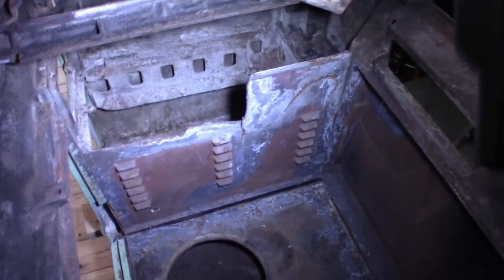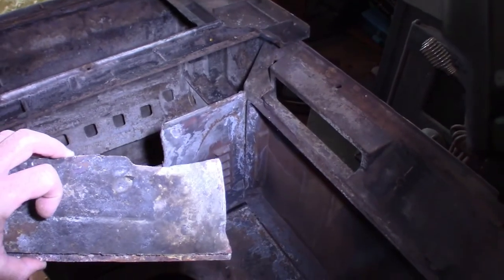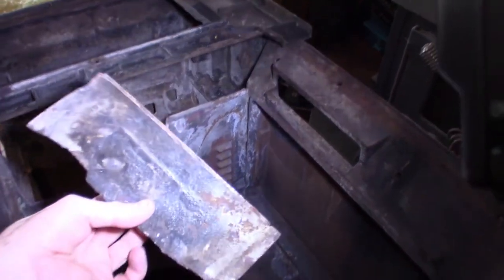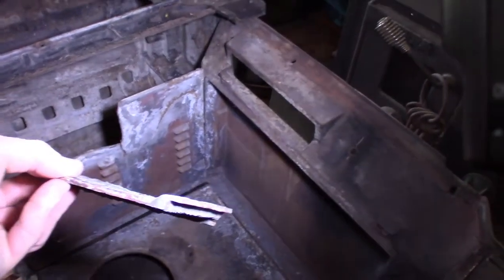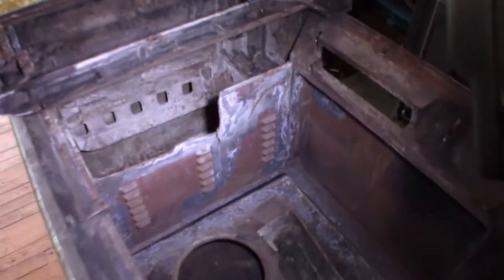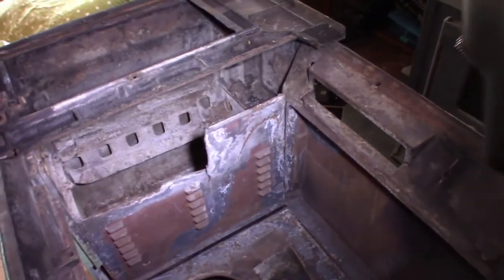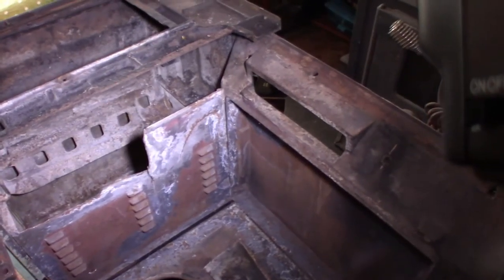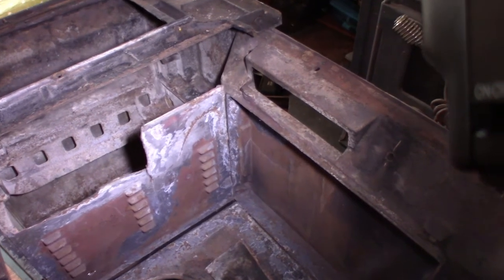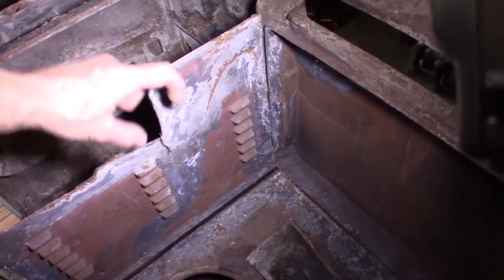There's that broken oven section, and there's the piece that came off this corner. We're not positive yet how we're going to fix this oven. This is definitely way too thin to try and weld. Cast iron is almost impossible to weld anyway. So our thoughts are possibly taking little pieces of steel and almost making like little stitches to put along the cracks and bolting them together.